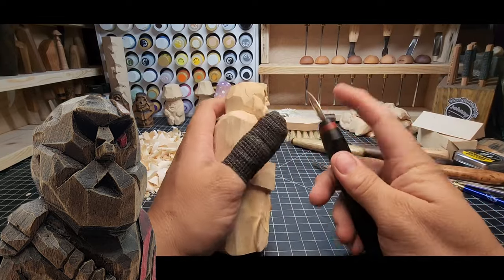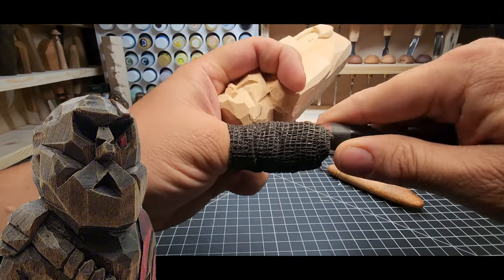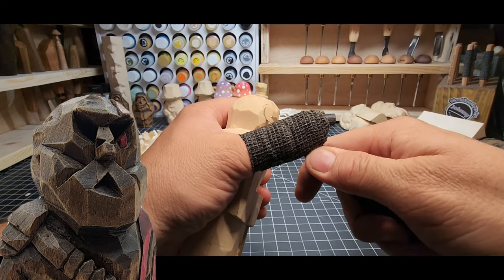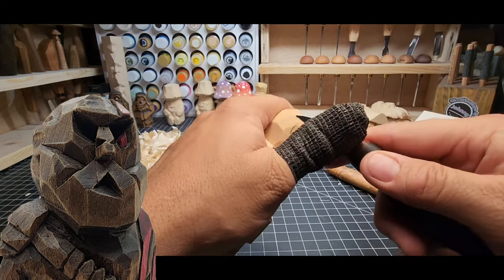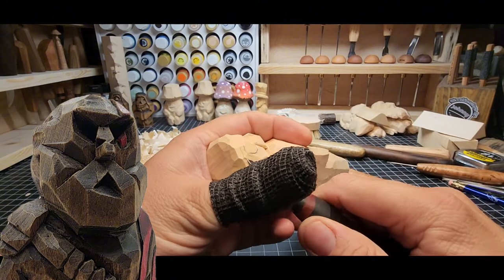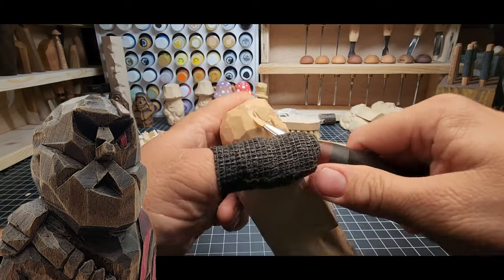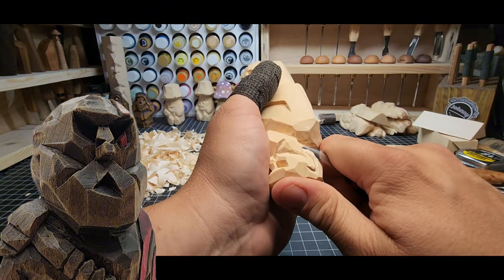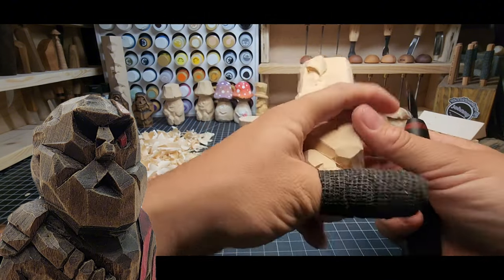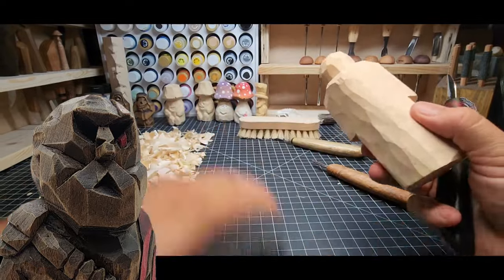Get those wood chips out of the way again. Now we can use this finer detail knife — I can pencil in or draw in this ear more easily, and this thinner blade sinks into the wood a little bit easier, so it's better for this kind of detail work. Just cut down to that and we'll provide some definition of those ears. I'll do this on both sides of course. Once we get some definition of the ears, we can come back in with a gouge — maybe a smaller number nine scoop — to scoop out the ear and get just a little bit of detail.